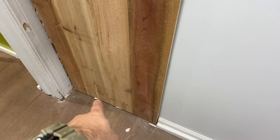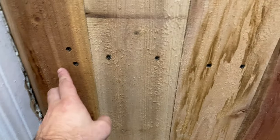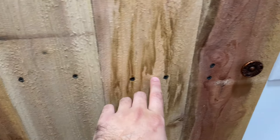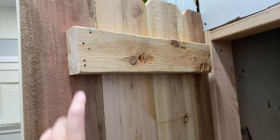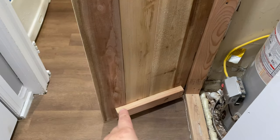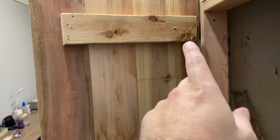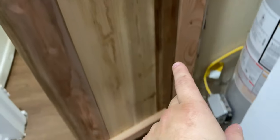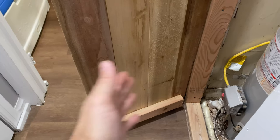You can see the stickers on the bottom. I've put them all together and you can see these screws are screwed into a board that's linking them all together. If I open the closet door you can see I used a 1x4 here, a 2x4 here, and a 2x4 down there. You could also run another 2x4 up here linking them all together, and one over here going down to build a frame inside this fence picket wall.